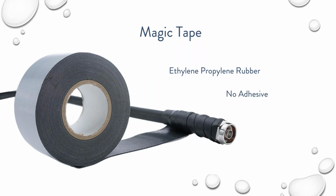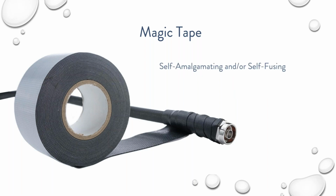And it has no adhesive, which, if you've been listening to the whole webinar, you can probably tell is a big deal for us. We try to steer away from adhesives in outdoor products because adhesives tend to break down in extreme temperatures. So Magic Tape's really great in that it doesn't have adhesive, and many of you might know it as self-amalgamating or self-fusing tape. So it's got this protective layer here that keeps it from adhering to itself when it's shipped. You remove that layer and then it fuses to itself as you stretch it over itself and around the connection. It will adhere to itself.